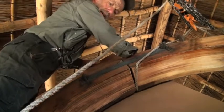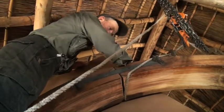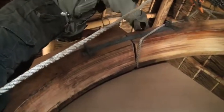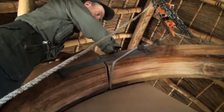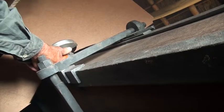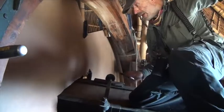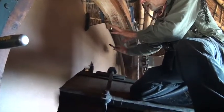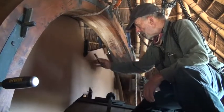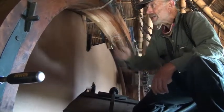We've got to clamp this on, and we need spaces at the back because there are these riveted pins through it and the ropes, so we can't quite clamp right up against the brake blocks themselves. We're ready with a square, because now we've got the relationship between the two. When we dismantle it we can lay it down in the workshop, put the bolts in again, match up the lines we've just made, then draw a string and work out the exact radius here.